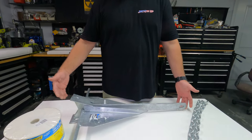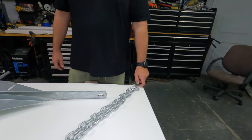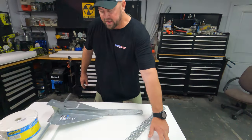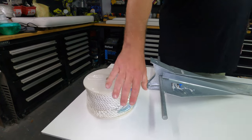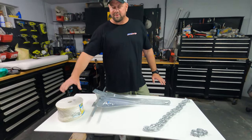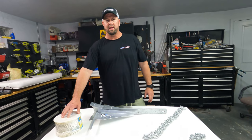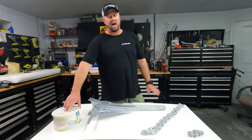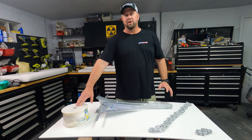Pretty much all you're gonna need — this is my inshore setup. This is a 13-pound anchor I just bought at one of the local supply shops. I got about three feet of galvanized chain, two shackles to connect to certain parts, and I also got a hundred foot of three-eighths rope with the thimble already on it. This is for an inshore setup, not offshore. This works up to about 60 to 70 feet tops, but I'd mainly suggest around 50 feet.